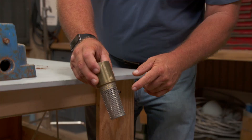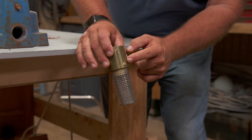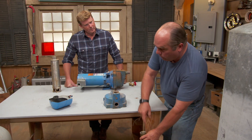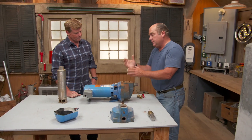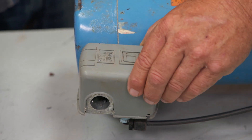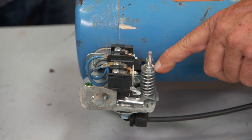How do these systems work? Let's take you through it. So you've got water under the ground, and it's going to be 50 feet down, it could be 500 feet down. At the bottom of it, you've got a foot valve with a little strainer and a check valve. That tries to keep water in this pipe that comes up through the wellhead and comes through this pump. This pump sits and listens to one thing: a pressure switch right here.